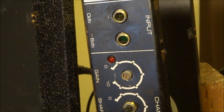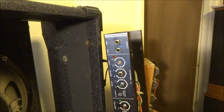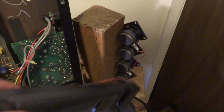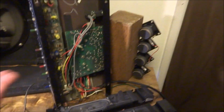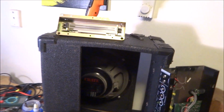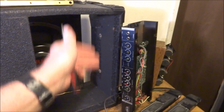It's easy to adjust the gain now with the screwdriver, but before I check if that gets rid of the noise that was very, very loud, I'm going to create a circuit with a bunch of smaller speakers. I'm going to put all these speakers in series so that it's going to be a circuit that's like 100 ohms of resistance instead of 4 or 8 or 16. That's not going to hurt anything. It's safe to do. It's just going to make it so that you can't turn up the amp very loud.